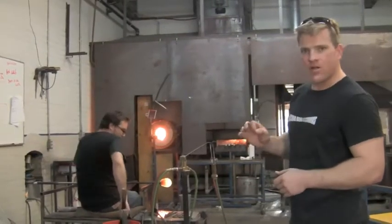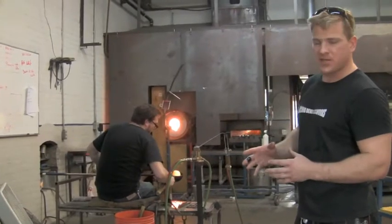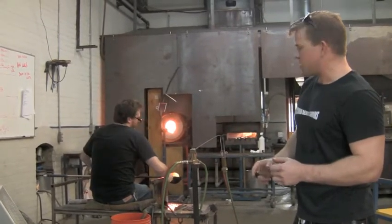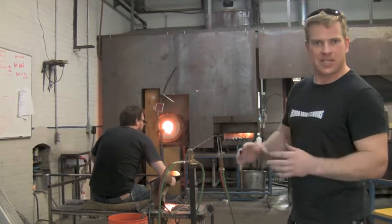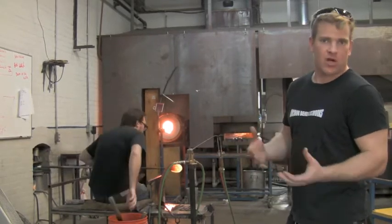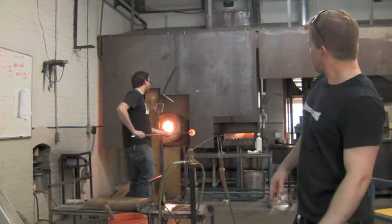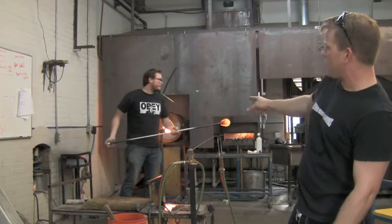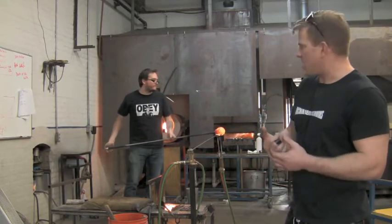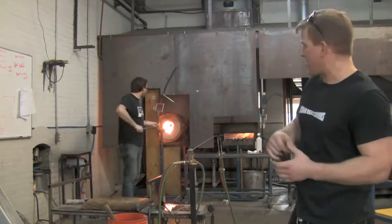There's a tiny air bubble in there. He's working on what's called a blowpipe — it's hollow all the way through for actually inflating the piece. But realistically it's not as much inflation as you would think; it's a little bit more utilizing heat and turning. So it really should be called glass turning, but we're going with glass blowing. You can see him — look closely — he's actually trapping a little bit of air into the hollow pipe, and with his thumb he's making sure that the air is going up into the hot glass instead of out the back end.